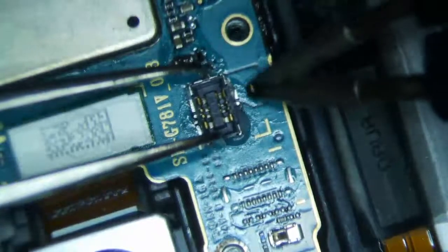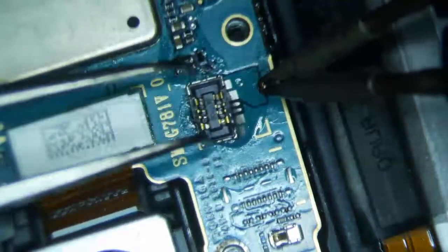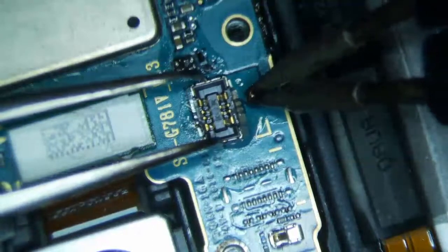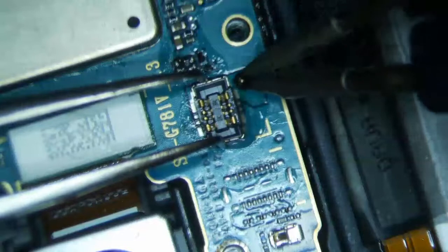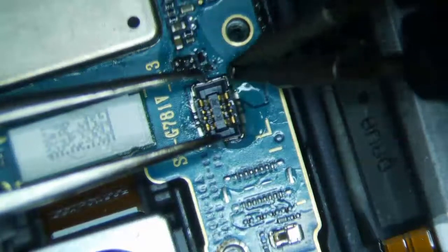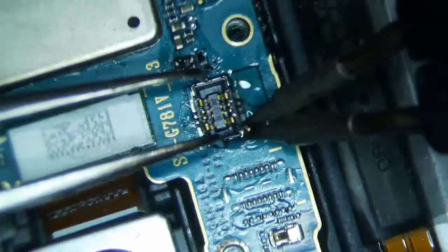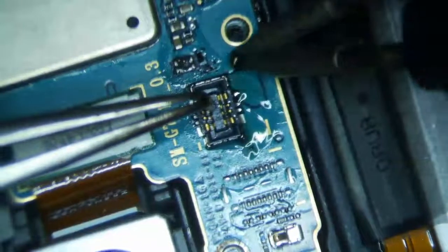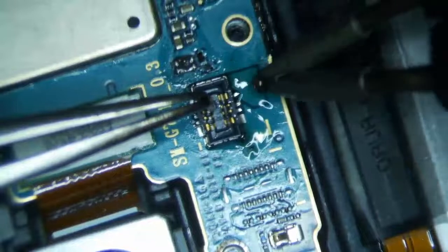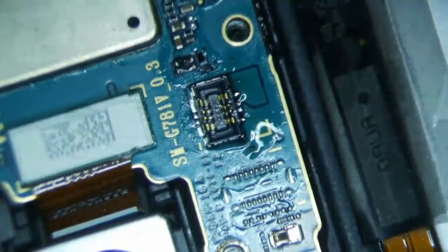Now I'm going to switch over to my nano tweezers. For the nano tweezers, I exclusively use the C105-101 tips, which are the 0.1 millimeter tips — basically the smallest in size. These do go bad. The 0.1 millimeter turns into probably like 0.3 millimeters after a short while. But you can still use them — they're just a little bit harder for tighter jobs over time. One of the biggest tips I got for preserving these tips was to lower the temperature on my station. I go to right around 290 to 300 degrees Celsius, and I leave it there and never change it. That seems to really preserve the tips.